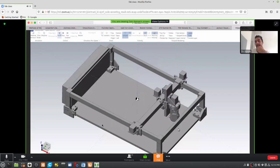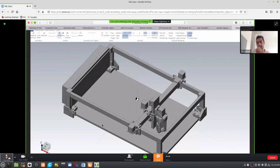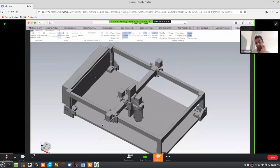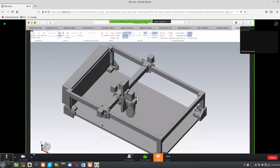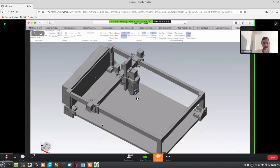And then just this morning I was playing around in Mastercam. I think I can get away with using a generic FANUC post, and Mastercam supports five axis machining, so I think that's how I'll be sending instructions to the machine. I don't have any limits yet, so that's still to do, and I have to test this tiny spindle, which is also still to do.